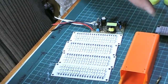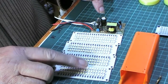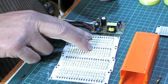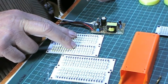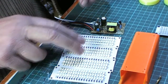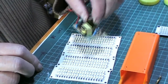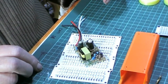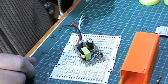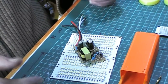Okay. Now, these boards can be wired in parallel, 12 volts. Two in series, and then in parallel, 24 volts. Altogether in series, 48 volts. And then 250 volts or 110, wherever you are in the world, whatever your voltage is. So, you know, it's not just a mundane CFL lamp, LED lamp.